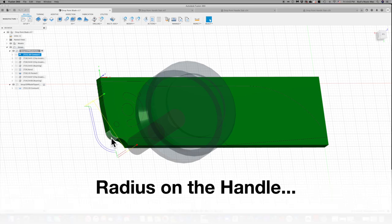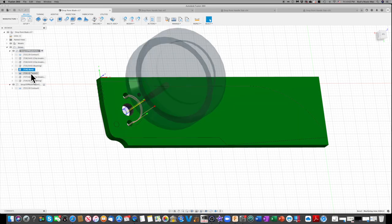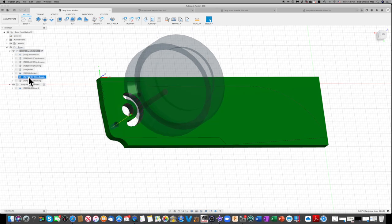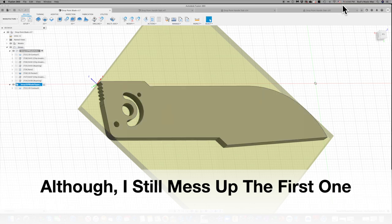On the manufacturing side, first we'll machine the contour to get the rounded end, making sure that radius lines up with the blade radius. Then we'll drill and ream holes, but I ended up switching to just boring the quarter-inch pivot hole on the CNC instead of reaming — I think that works out better. Then we'll cut the pocket, drill the last detent, ream it, and in the second setup we'll mill the finger notches on a 45-degree angle.